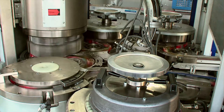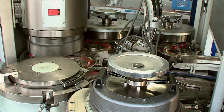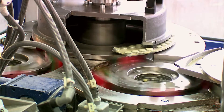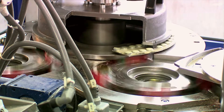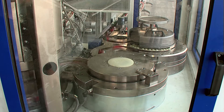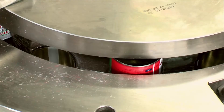The parting station breaks the double high-welded can bodies along the score line into an upper and a lower cylinder. The separating station then brings the upper can-body cylinder behind the lower cylinder.